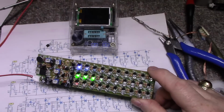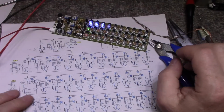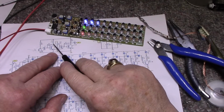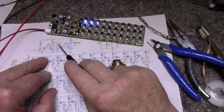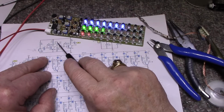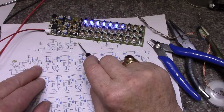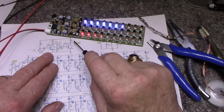Okay, so this thing's purely microphone input, but if you wanted to make this feed a signal in, I guess you could do a few things here. You could try feeding the signal in at this point, this little amplifier here. I don't know what kind of signal's coming out of here, and this is your volume control here. And then there's a coupling cap. So you could do it just before the trim pot, or you could do it after this entire stage and feed it in here, probably right here, after this cap. And you turn this down so you wouldn't get phantom readings from noises. You just want your music to trigger this.